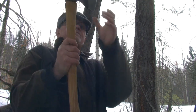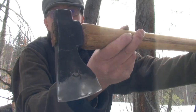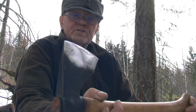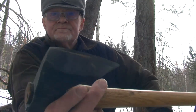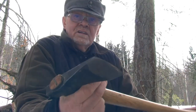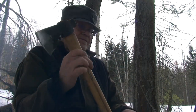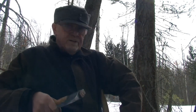Many of you will know this. This is the Les Stroud Bushman axe. When I bought this, it was zero ground, which was one of the issues regarding some folding on the edge. I didn't think there was anything wrong with the steel, but I just stropped it to a nice fine convex, and this axe cuts very well, way above its weight. The whole package, head and haft together, weighs 2 pounds, which is slightly less than this Stoller that I made up.